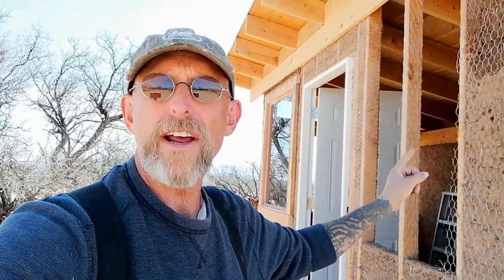So our goal today is to get all of the brickwork done. We're going to use the better adobe bricks that Yvonne has made, and we're going to be filling in these areas here and around the corner using a brick pattern. We haven't decided what pattern we're going to do, whether it's just going to be a running bond, a standard brick design, or whether we're going to do something a little fancier.